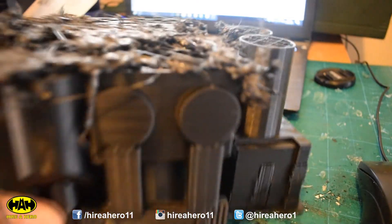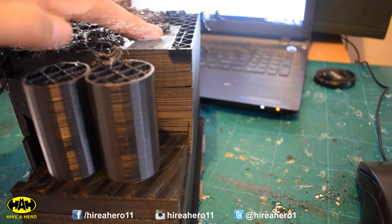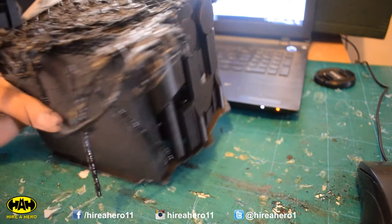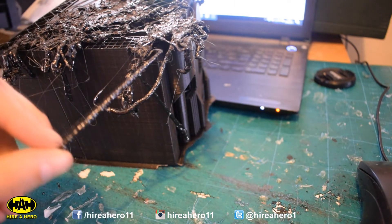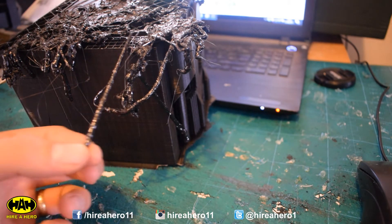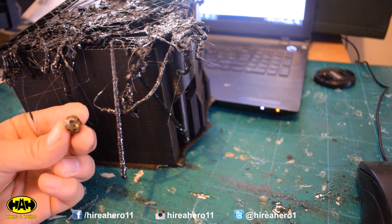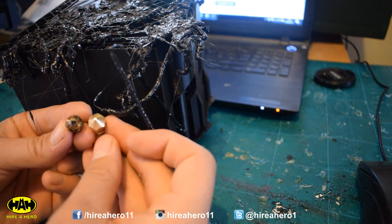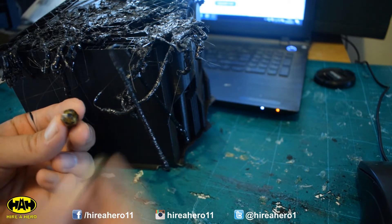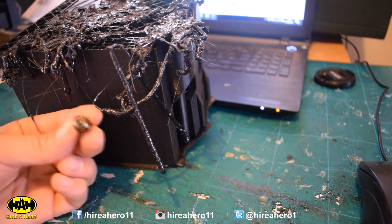Here's that piece that failed spectacularly. It's gone all weird up here — it kind of got to this layer here, which is the last bit it did well, and then it went totally crazy. It started extruding really big thick pieces. The only way it could do that is if the nozzle grew from being 0.4mm to about 4 or 5mm — and that is exactly what it did. The hole in the end of a good nozzle should be teeny tiny, but on this one you'll easily fit a bunch of sewing needles. It's for some reason grown massive.